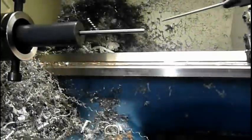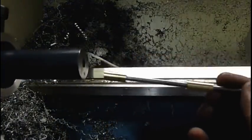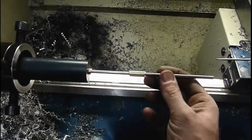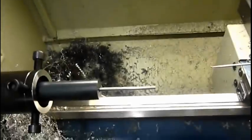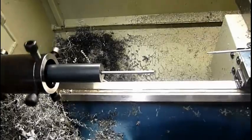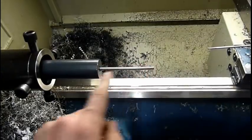Then I have this bar that I made that rides inside on the rifling. It's a piece of carbide with two brass bushings that I've made that go on it, and you slide it in. It's a very tight fit — not super tight, but close enough for what I need. Then you come in and put your indicator needle on this and dial in on that.